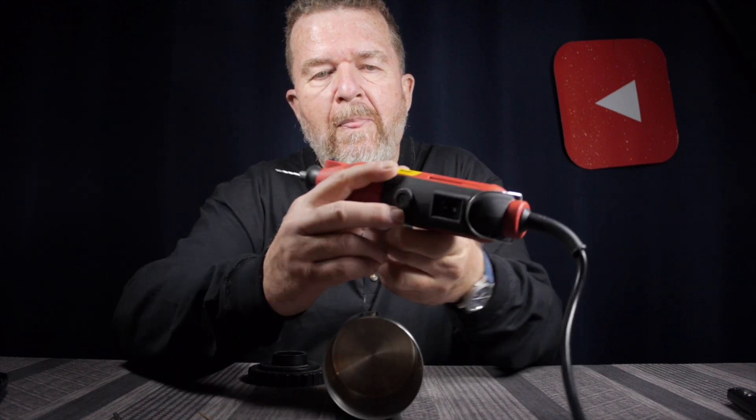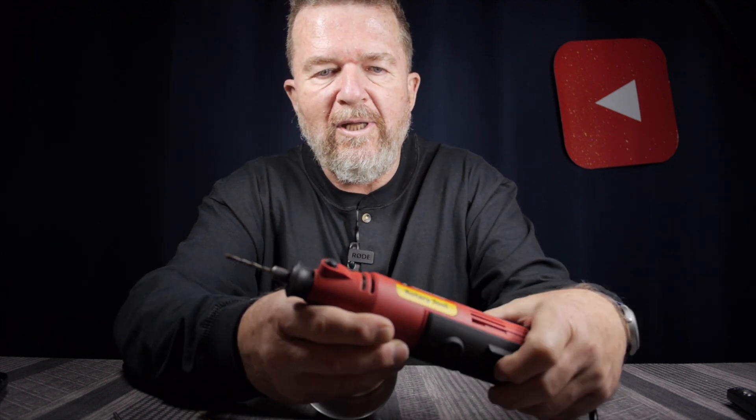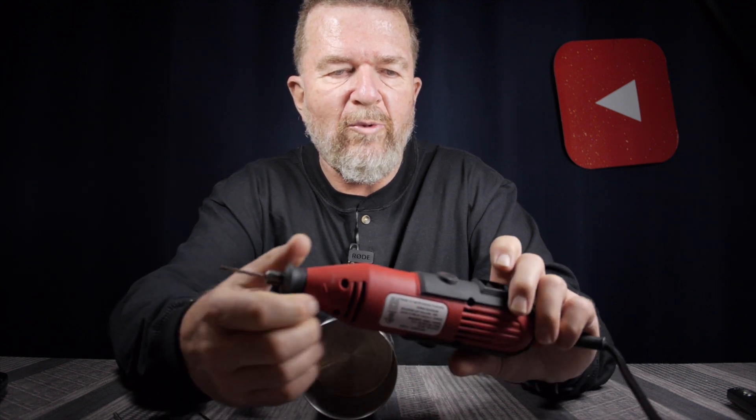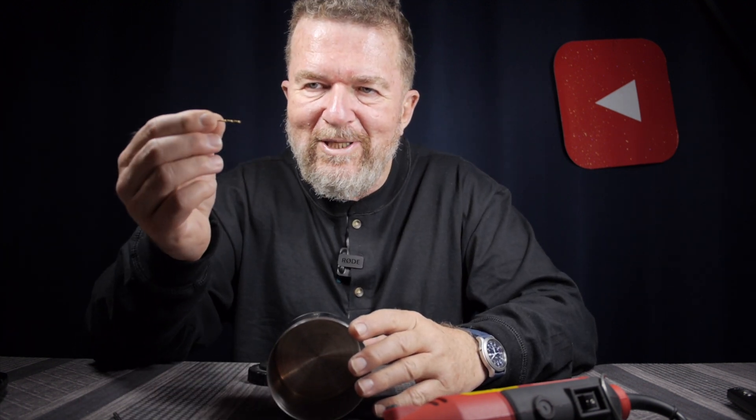I couldn't do that — it was too tough. So I resorted to using a 3/16th drill bit, the kind that fits into a rotary tool — basically takes the same attachments as a Dremel. With this conical tip on the drill bit, I was able to work a little tiny hole right in the steel, just enough for the tip of a 1/16th inch drill bit to dig in once I used it on my drill press. And then I was able to drill a 1/16th inch hole through the tank, and then use the larger conical drill bit to finish drilling the hole.